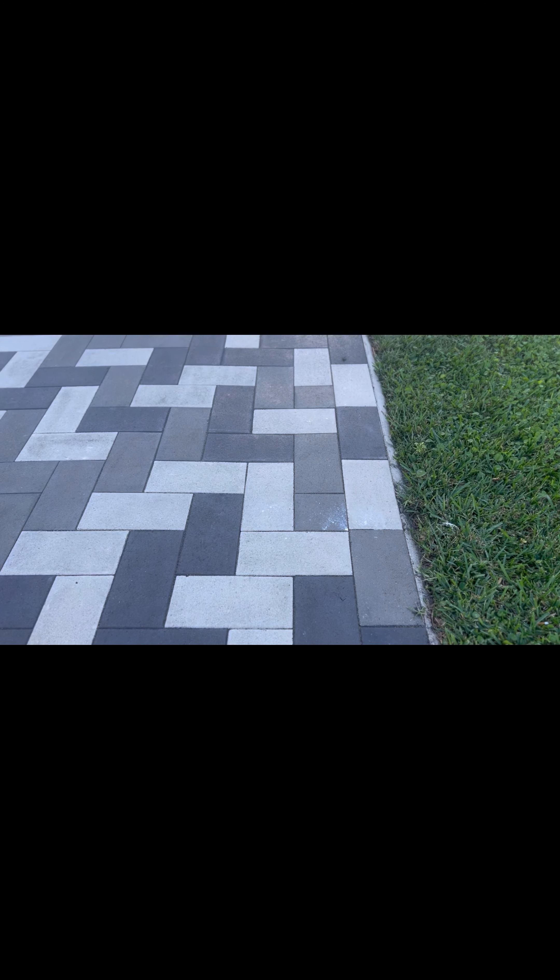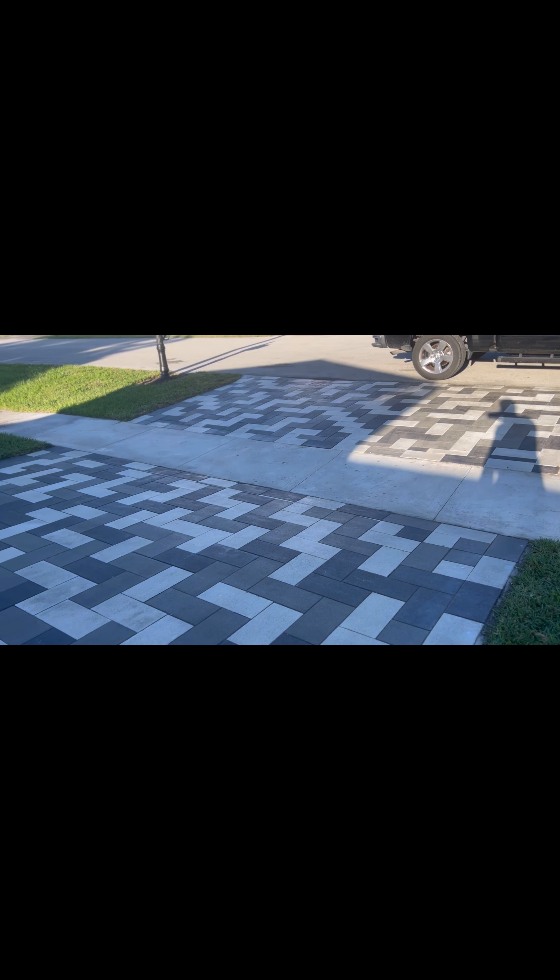Here's the end result right at sundown. Shadows, but you can tell I put the last coat on. Still absorbing a little over here, but see the color back in the pavers — that's what I wanted, not that faded color. Got a couple of dark spots — I should have used a real pressure cleaner instead of that little one. But overall it came out good. I wanted to bring the color back and it definitely did. The joints are all grouted again, sand is between them with that polymeric sand so it won't wash out. Thanks for joining me — hope to bring you another project soon.